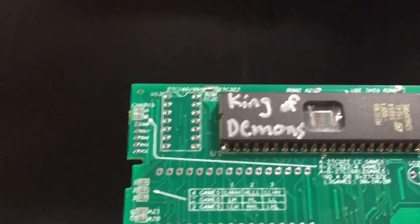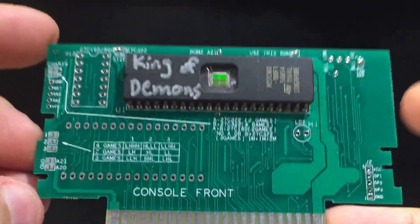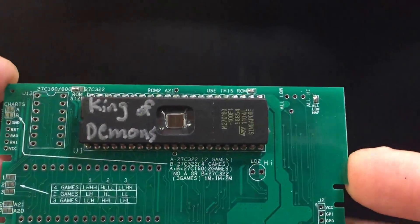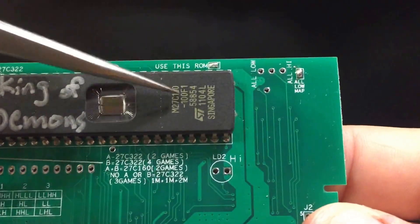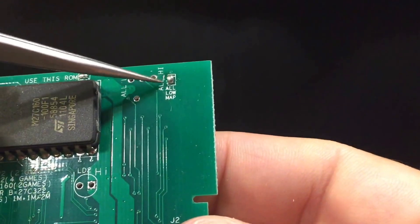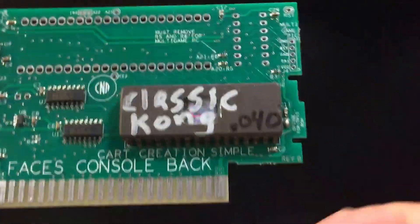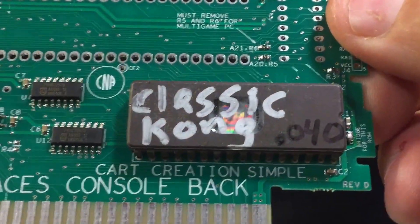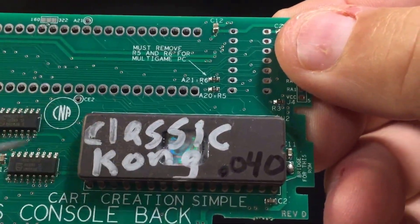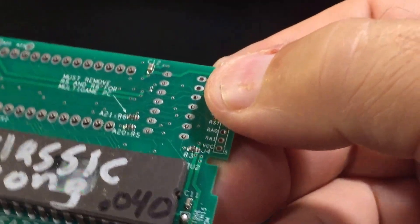That's a recap. If you're going to make a single game like Pocky and Rocky, King of Demons, Demons Crest, or Castlevania X — there's a whole host of games that don't use SRAM. So just to recap: you do your ROM size jumper, you tell the board you're going to use this ROM by bridging that spot, and then if it's high or low you either do or don't jumper that one. If you're making a game like Wild Guns or something one megabyte or smaller like Battletoads, you can use a 27C080 and do the jumper to tell the board to use that ROM. And you're done.